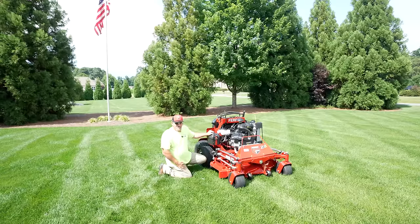So when it comes to changing hydraulic filters and stuff like that, even as much as a hydraulic fluid change, a lot of times we take that to the dealer. But looking for hydraulic filters in this thing, here's the gas tank, so I know it can't be right there. Let me go over here to the other side and see if I can see it. Usually when you follow the lines from the reservoir, that will take you to a filter, if there is a filter. And I'm just simply not seeing a filter. It could very well be back behind this framework, but I don't see it. I would definitely take this to the dealer to get the filters changed and the hydraulic system flushed and new fluid put in.